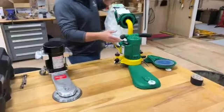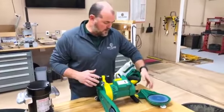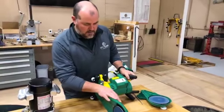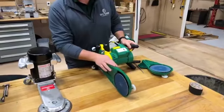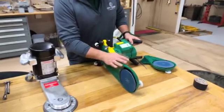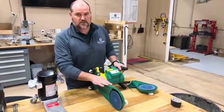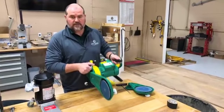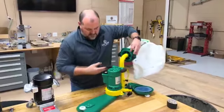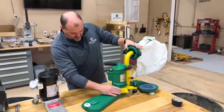The Flip is a belt-driven edger, so it does have carbon brushes. It has a magnetic switch. It does have a style of plastic — you'll see this style of plastic a lot on Festool tooling. It is kind of bulletproof plastic; it just doesn't break. You can drop it and do all kinds of things to it — it will not break. It does make the unit fairly light. This section that the motor is sitting on is yellow — it is metal, I'm assuming it's aluminum; it feels like cast aluminum.